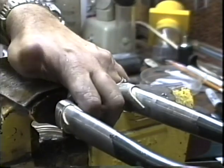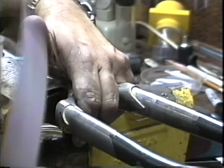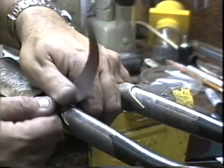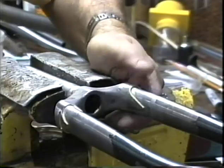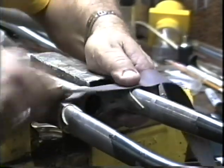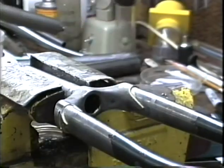I keep calling it emery paper. I'm sorry. There is emery paper that's available for some polishing maneuvers. I can't think of really anything that you can use emery paper for in frame building. I'm recommending that you use strictly emery cloth because of its flexibility, and it's quite a bit more durable than emery paper.